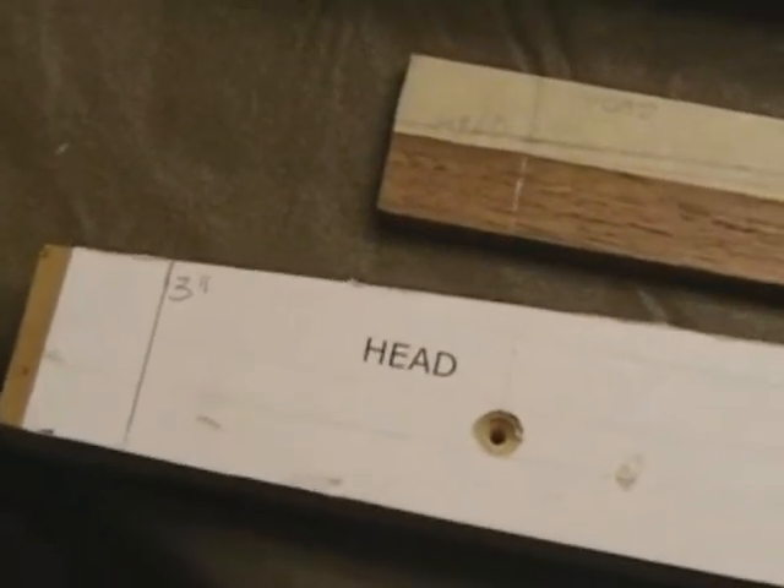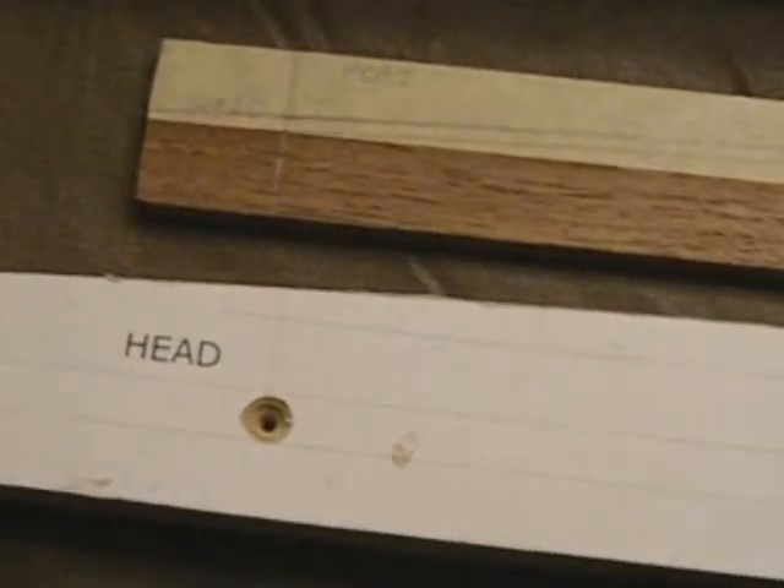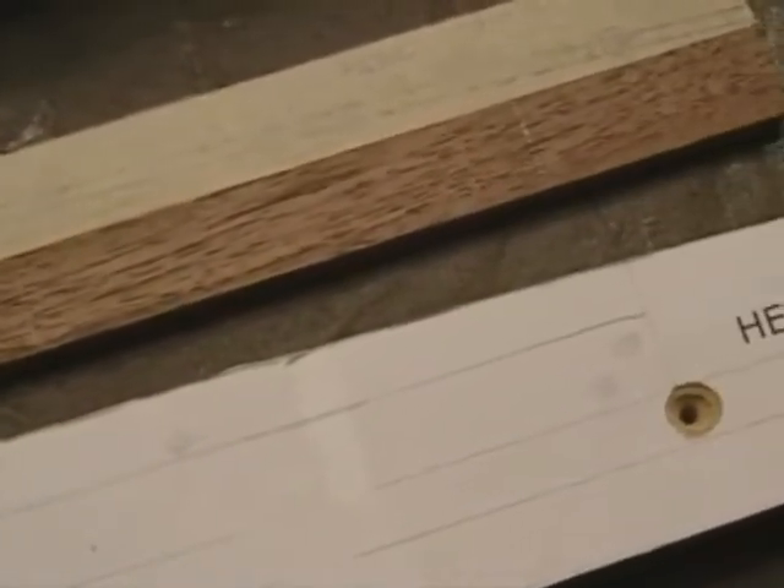This is the template I used to mark off my blank for the skunk strip. You can see on the masking tape how it matches the arc in the channel. I kept it the same depth so that when it's sitting into the channel, I know I need 3/16ths sitting proud of the back of the neck.